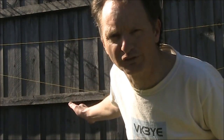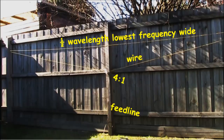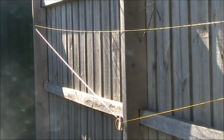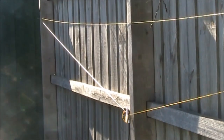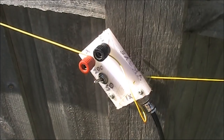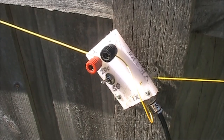A short video about what has been described in QST as a clothesline antenna, but it's got a twist. As described, it was a folded dipole with a characteristic impedance of around 300 ohms. I've opened it out a bit to make it more like a loop, which should give it a feed point impedance of around 200 ohms.